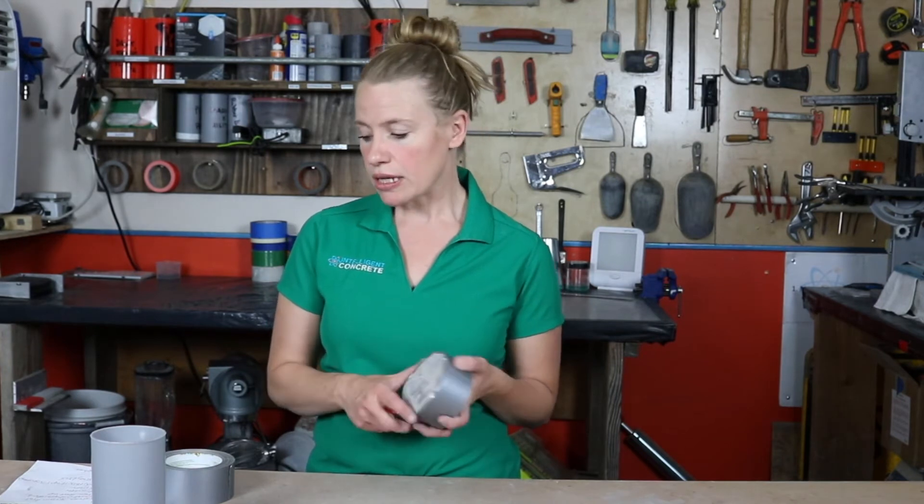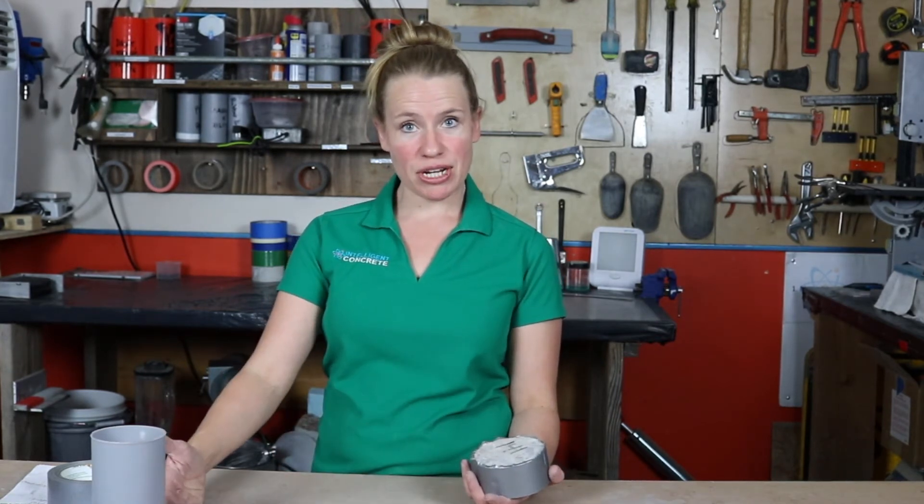Once you do that, you're going to put some filter paper in the bottom of the container, put some water in there, and you do a reading at 60 seconds, five minutes, ten minutes, then every ten minutes from there until you hit an hour. I always pull out the standard and do a quick review right before. Then you're doing it hourly until six hours, and then you measure it once a day for eight days — that's the information you collect.